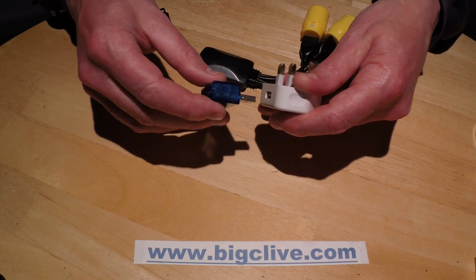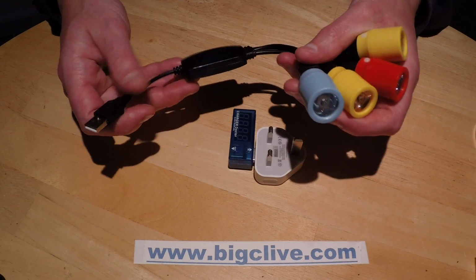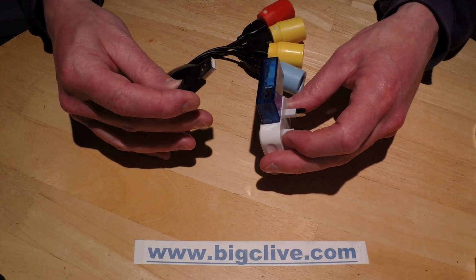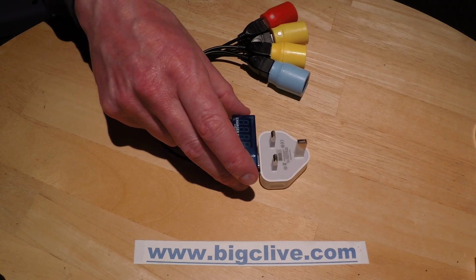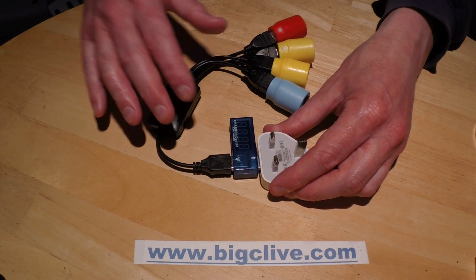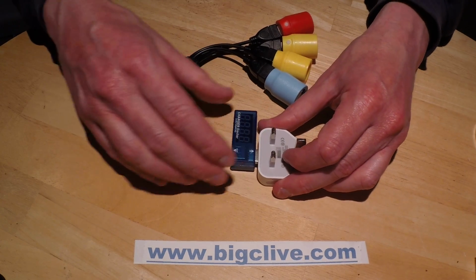But anyway, once I'd sorted that out, I plugged it in, and I plugged in this USB splitter and this hub, and I plugged in 4 of these lights, which take roughly about 150 milliamps each. But I have to say, I'm not overly sure about the accuracy of these units, and I'm pretty sure they drop a small amount of voltage across these. Well, they must, to sense, of course. And this also seemed to be limiting, so I wasn't able to really get a good accurate test. The voltage started off at 5.3 volts and it went down a bit.